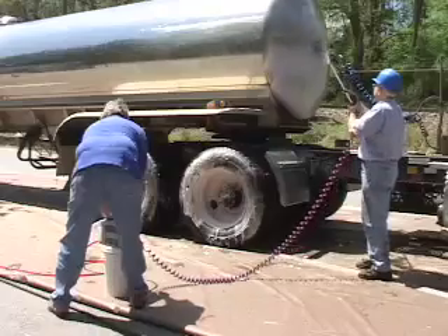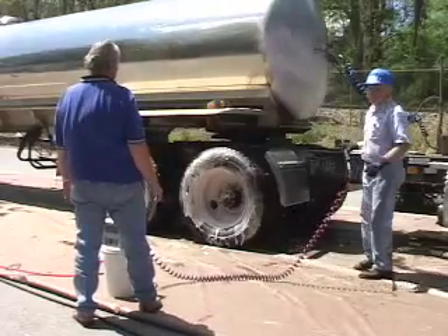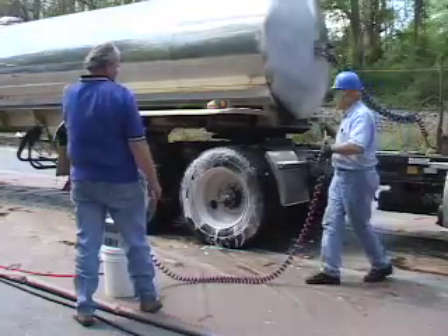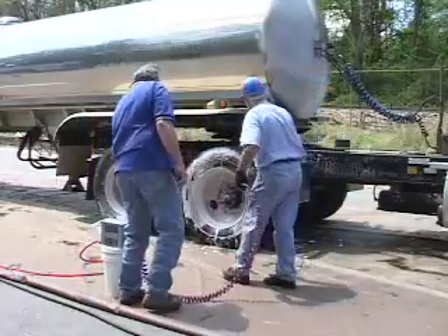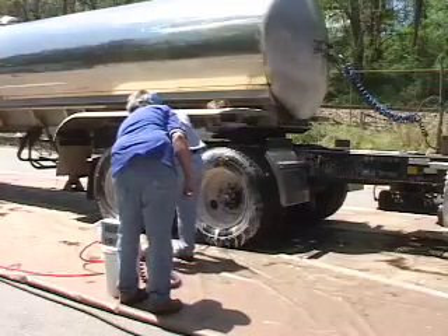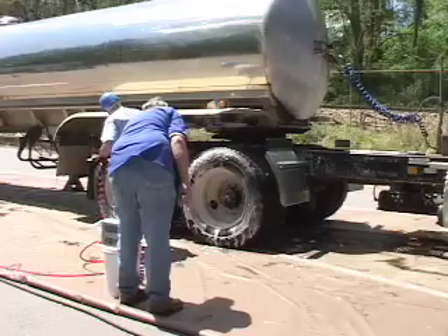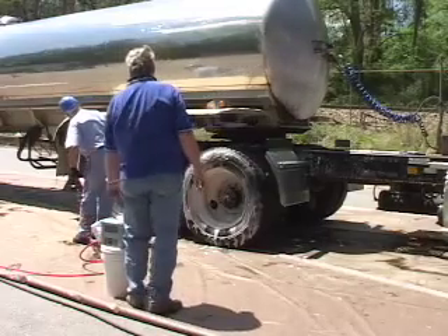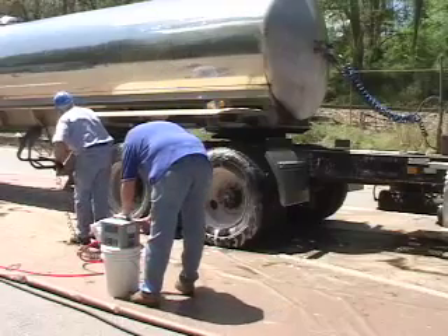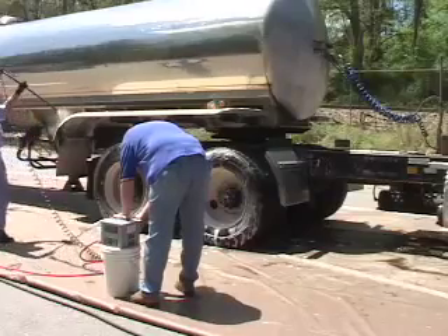We're getting fairly good dwell time — it runs between five and ten minutes. Good pH concentrations. Technical people were testing pH continually to see what kind of dilution rate we were getting on the application. This was our strongest foamer, using about three quarters of a cup to five gallons to get the dwell time needed. The kill time was based on the dwell.